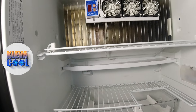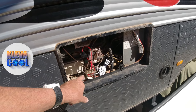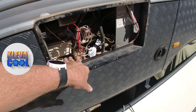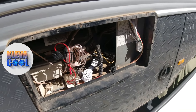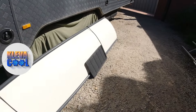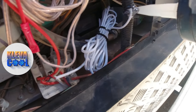Now just go and connect the power. Like with the fans on the top, we had to put a fuse in — but the fridge fans don't need a fuse because they've got an automatic shut off fuse there, so no need for that. Just straight into the power. I've tidied these up and I've kept all the lengths just in case. I'm really happy with the job — all I need to do now is silicone that and put the cover back on and we're done. So just adding a bit of silicone around here to make sure that's not going to leak.